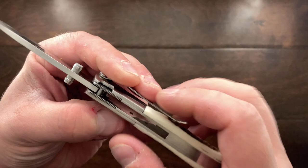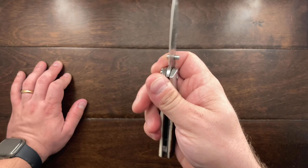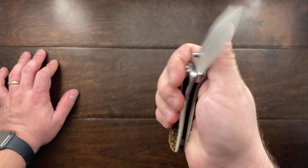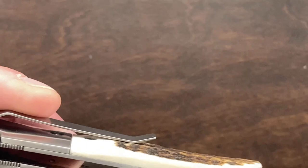This knife was assisted — it had a spring that ran up the back and into the handle, making it a spring assisted knife, and I did not like the action on that. It was not very comfortable or smooth. It also had a slide lock on the back that locked the liner lock in place so you could not close it, essentially making this somewhat of a fixed blade knife. It was not very reliable, so I disassembled the entire knife and removed that.